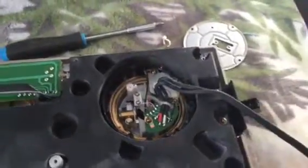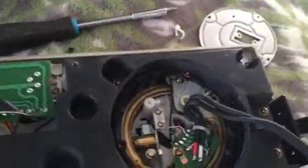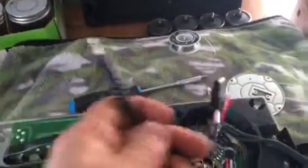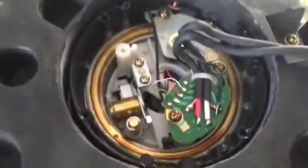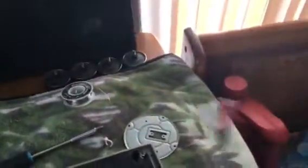Quick video - I'm replacing the RCAs on this because they went bad over time from tucking the wires in and wrapping them up. I decided to fix it so I'll be able to connect and disconnect the RCAs using female ends coming off, running out of the table, as opposed to hardwiring the RCAs directly into the circuit board again, because it's a pain to have to solder and desolder over time.